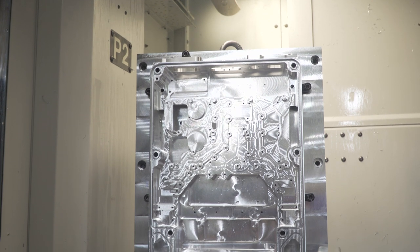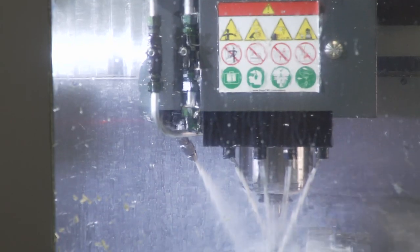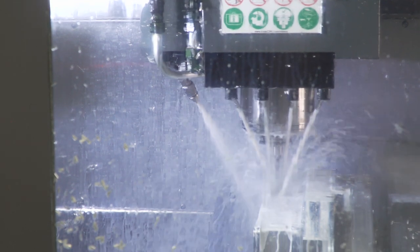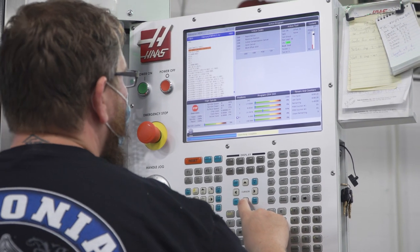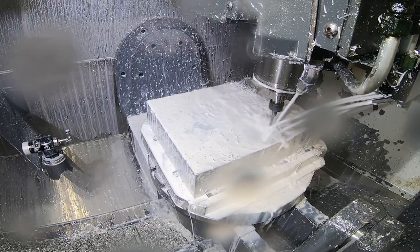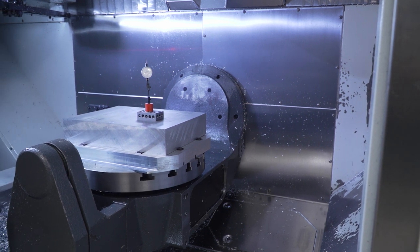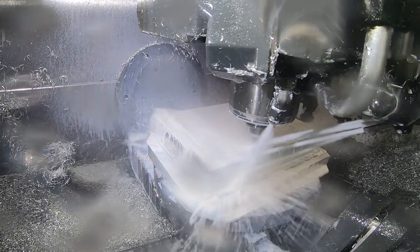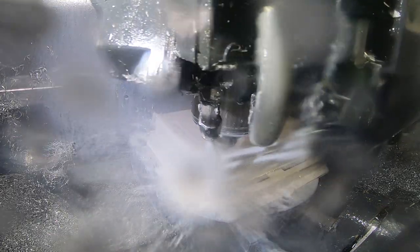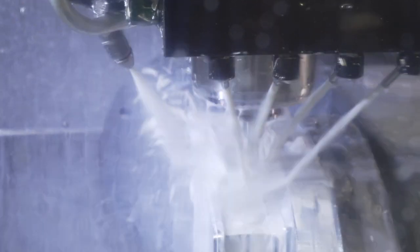We're currently working on a next-generation hybrid bus and we're evaluating options through high-speed machining that we're able to do on the UMC 500s, as a comparison to making and paying for casting tooling up front. We start with a solid billet of material and machine it completely. Because of the high-speed machining, we can ultimately remove the material so quickly that it offsets the benefit of material reduction in the casting, while providing the integrity of a wrought part versus a cast part.